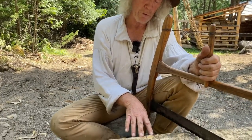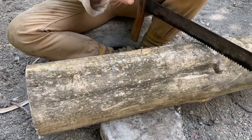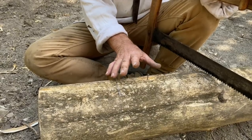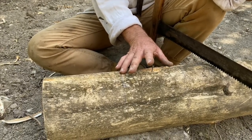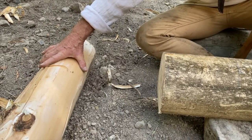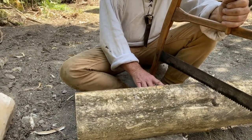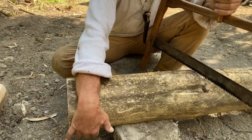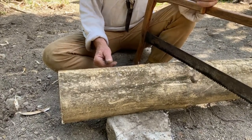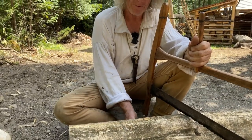So here's the method I'm going to apply. I've driven a small nail in each of the front four corners, if you would. That allowed me to get corner to corner square. My next step in making this tenon notch, as I mentioned, quite simple, is I've taken the width of the log that's going to marry it, and I've scribed out a line here and here. And then I'm going to go down like a flat in the bottom here to sit on my corner rock. So I'm going to go down a quarter of the way through the log, assuming a quarter's been removed off the bottom, leaving a solid half of the log for support or structural integrity. So I've got to saw this out, chisel it out, and I'll have my first notch made.